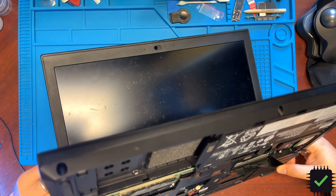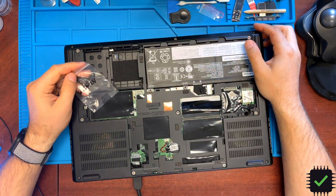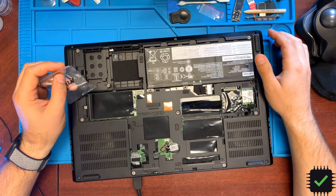So that's the story behind it. I already took it apart and discovered a failed MOSFET, which is SM3412N in this area. I have to take the board out completely again to replace it.